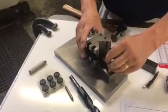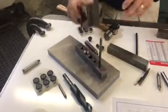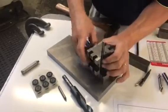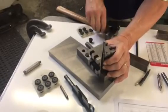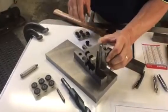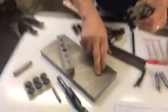If you're transferring a hole on something thin, like a piece of angle iron, you can use a v-block — they come in all sizes. Slide the v-block up there and hold your transfer screw or transfer punch straight up and down. When transferring through a thin piece, you could easily be off on an angle a little bit. The v-block helps hold your part and keeps things straight so you get a good, accurate mark.